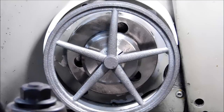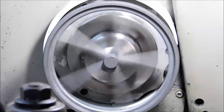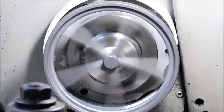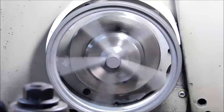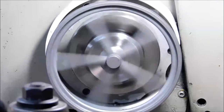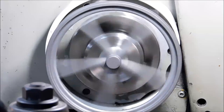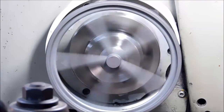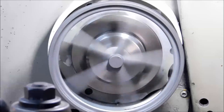130 RPM. Now, if you look at the countersunk screw, look at my hand, if you look at this screw in the headstock versus the inside of the rim against the shadow in the outside here that keeps opening and closing versus the eccentric, it is hard to tell which is running out more. The hub in the center is definitely running out. That's unpleasant to see.